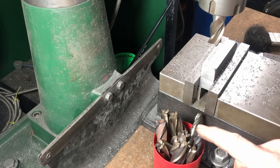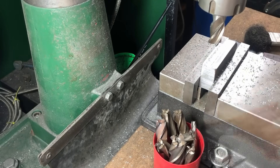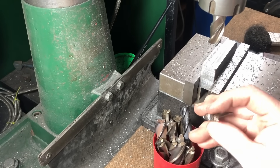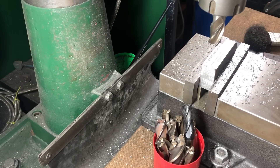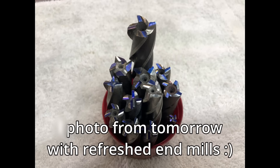So these are all the end mills that have got bad ends - they all need sharpening. These are the only larger ones I've got. I've got a lot of the smaller ones, but the larger ones I was running out of because sometimes you get steel that's hardened and you don't know it, and by the time you've skimmed over it, it's dulled the end mills. Getting a bit late today - tomorrow I'm going to grind all those up and make them brand new again while I have the lathe set up. Full credit goes to Rob for posting his video that gave me the idea. Hope everyone has a great day and we'll see you in the next video - thanks for watching.